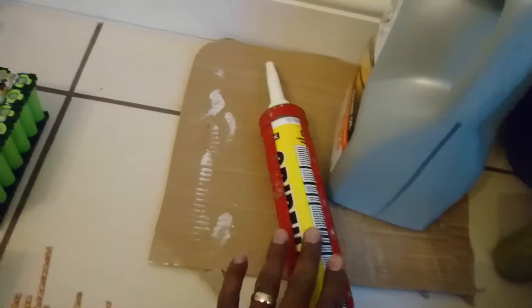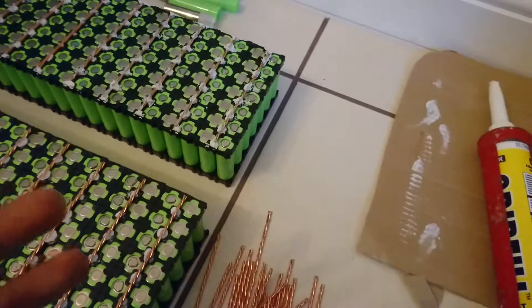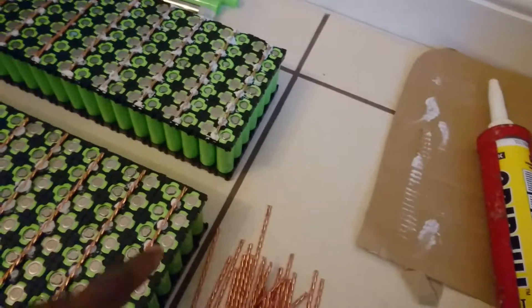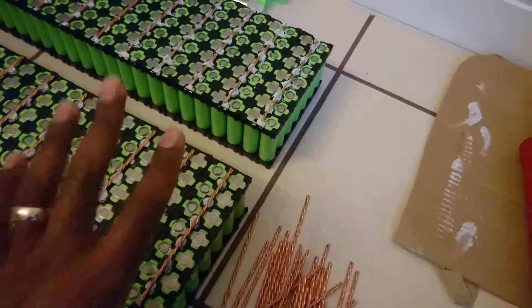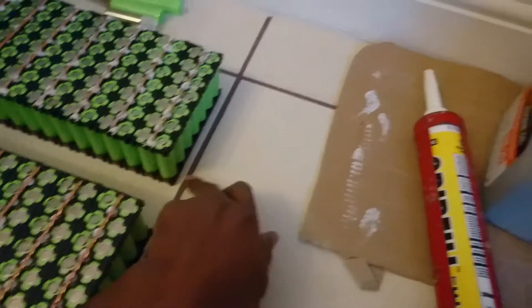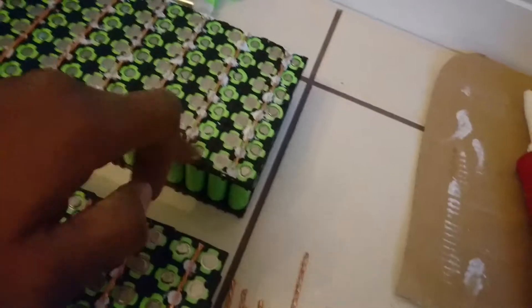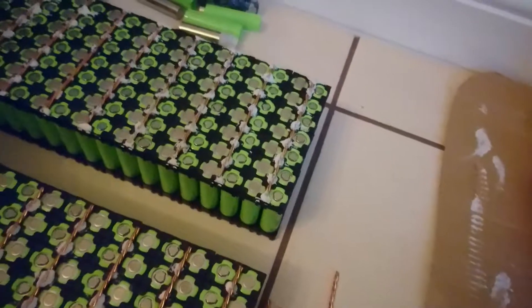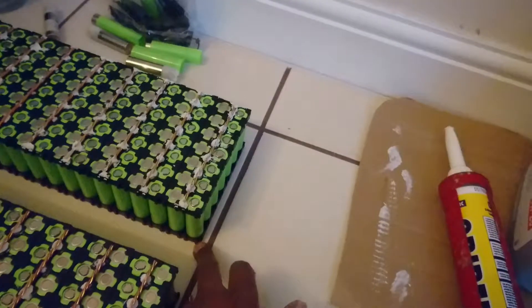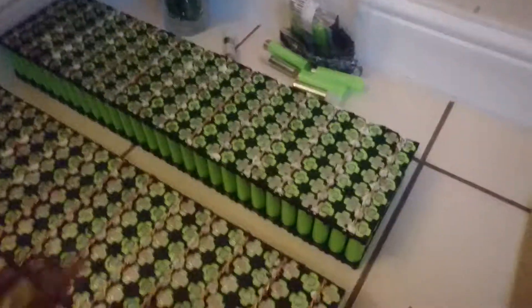I've glued them with this — it's not a problem in terms of fire. It is better to use hot glue, but I don't have it at the moment. For now I think this does well — it's called fill grip or go grip fill. It's working very well. These bus bars that are here are going to go at the bottom. Because as you can see, I've put the bus bar here — this is plus, negative. On the other side at the bottom, the reason I don't have a bus bar there is because the other one is going to be at the bottom. So they go like this all the way to the end. Then I'm going to have a terminal on this side for negative and a terminal on the other side for positive. The same thing applies to this pack.